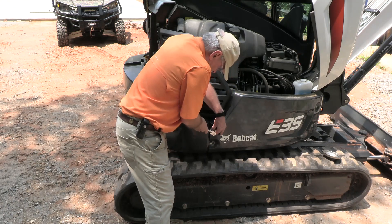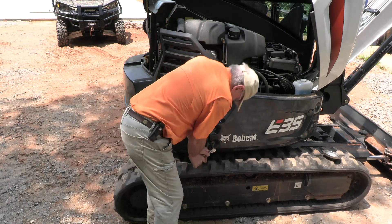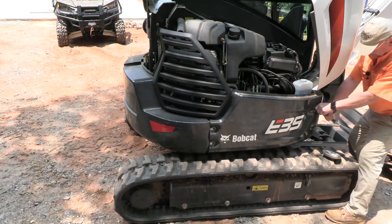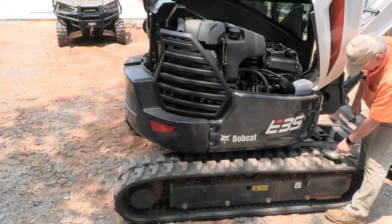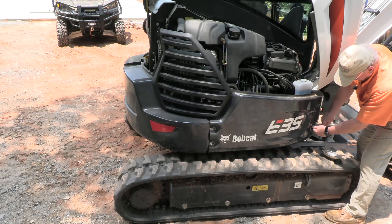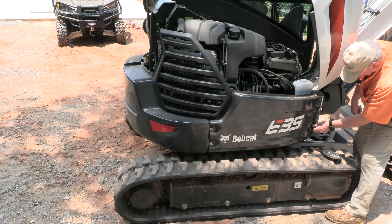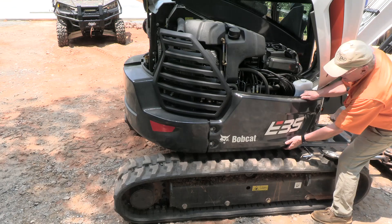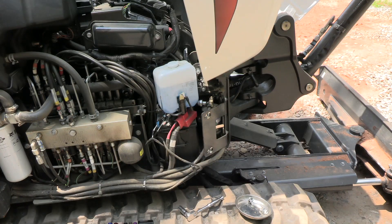To take this panel off we need to just loosen these two flange bolts — these are all 15 millimeters — and then we'll take the other two off so we can slide this panel off. We'll keep them in this little magnetic dish so we don't lose them; if you drop them in this gravel it's kind of like sayonara. Then this panel should just slide off, just like that.